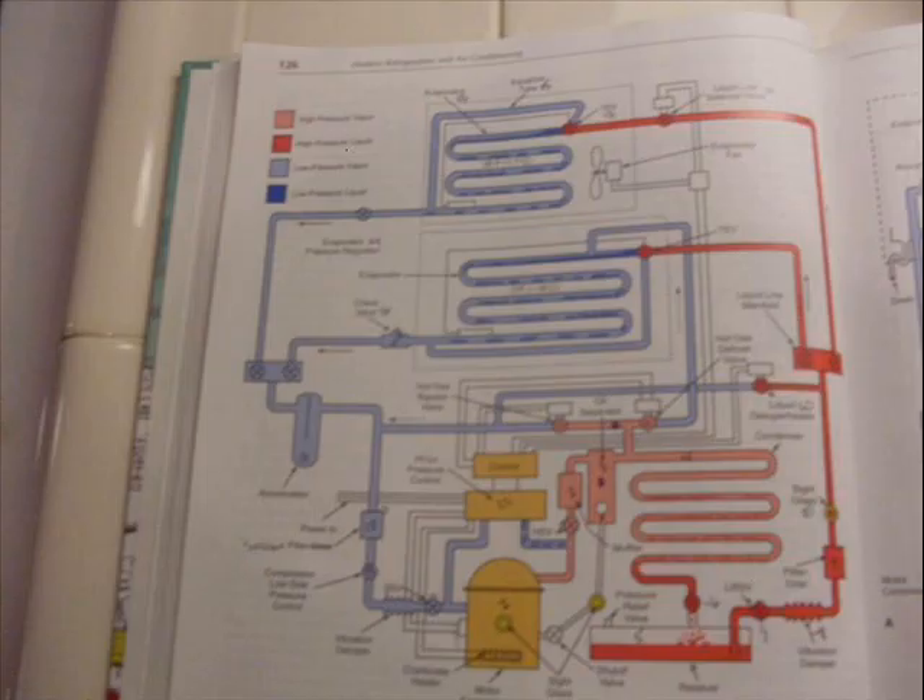I did something similar with the hot gas bypass, but on mine the hot gas was sent all the way back into the compressor. On this one, we bypassed gas around the condenser. Commonly called a headmaster — it's a one valve with three ports located on the discharge side. They are using a two-port system with two valves that does the same thing, where normally just one valve would be the headmaster. It maintains the proper high-side pressure under low ambient conditions. You'll find headmaster in chapter 13 of this textbook.